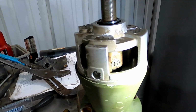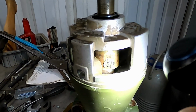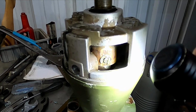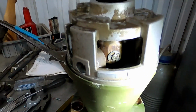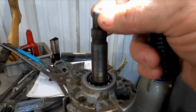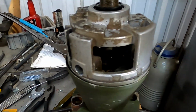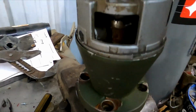if you look inside here, you'll see a little C-clip on there, or E-clip, whatever they call those things. I'm going to pop that clip off, and then there's a pin that clip is on, and I can just push that pin in with a Phillips screwdriver, or an O-ring pick or something like that, and that'll separate the two shaft halves. Because basically you've got this shaft and then the shaft that comes out the bottom end, and this is what joins them. Okay, now after you get the clip out, you need to rotate this around.